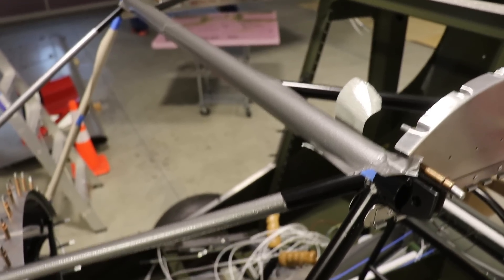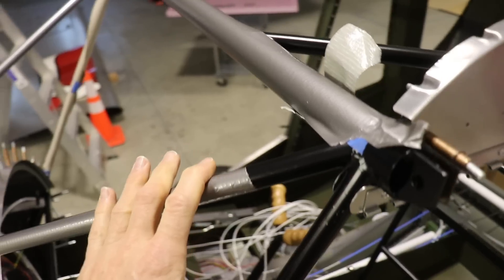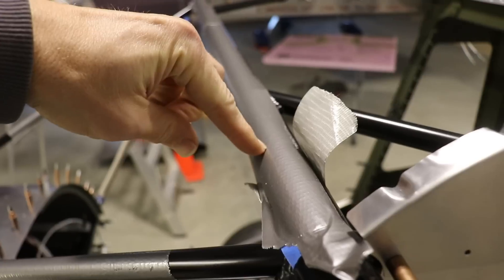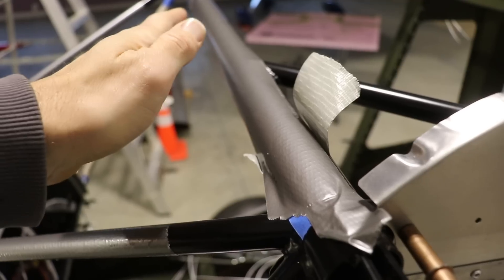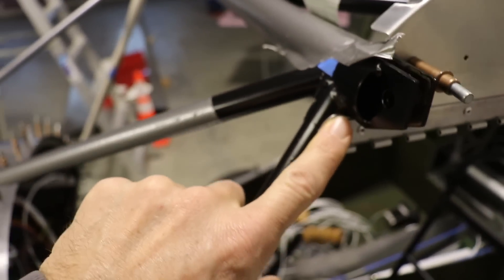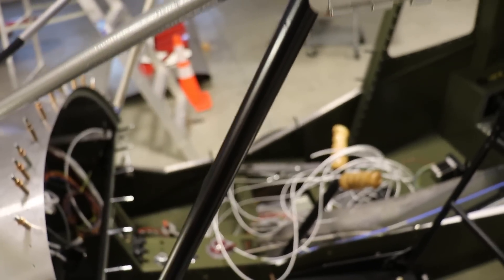What's on the agenda for today? Since I'm not finishing up these side pieces, there's something I want to do on the windshield. When I was looking at this top window I noticed that the back window only came back to about right here, which really doesn't give room for the screws that go in there. So I wanted the top of the front windshield to come back more. The way I need to move that back is to carve out a little bit more on the windshield right here so it can go back more. I've already carved this out, but once you move the windshield back, the back of the windshield that was even with the back of the tubes is now going to stick back a little bit more — so now I have to cut off a little bit more of both sides of the windshield.